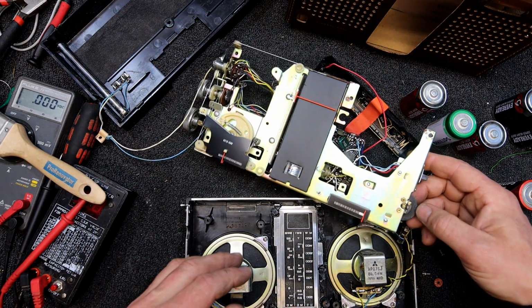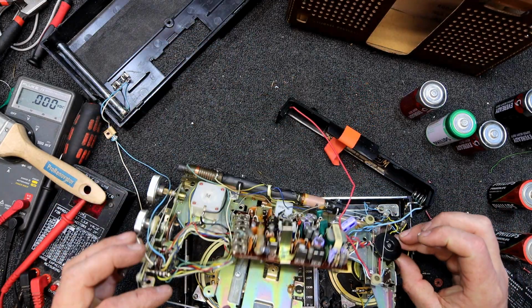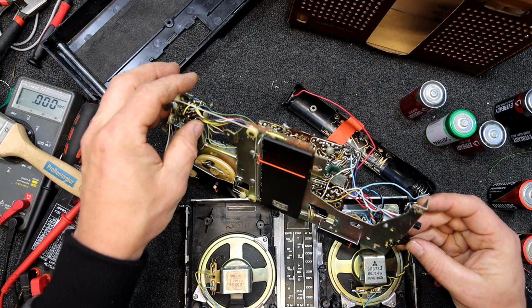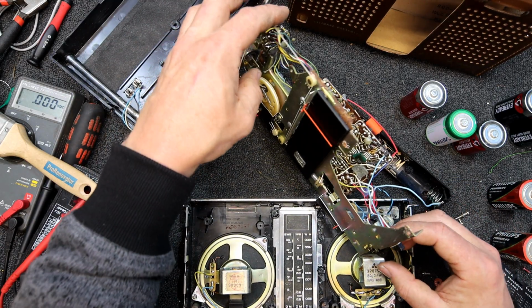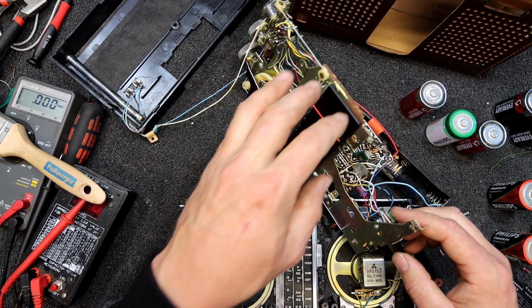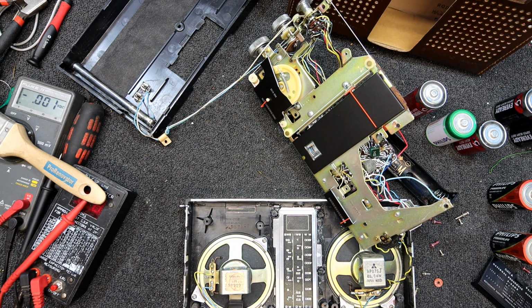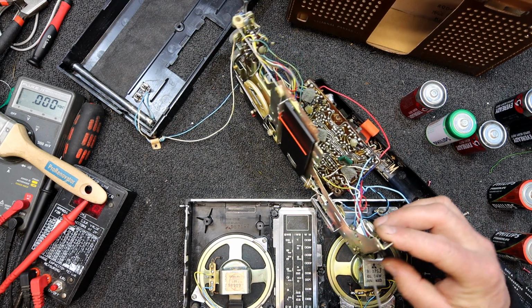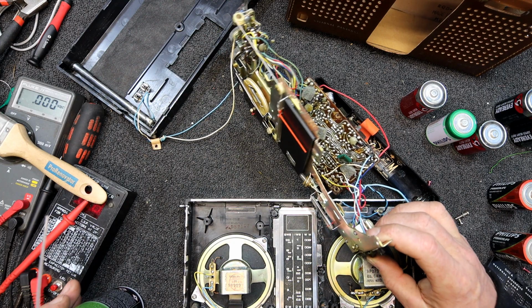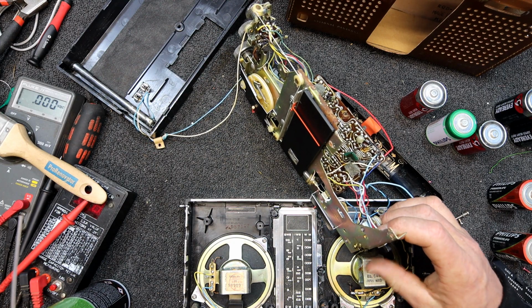And yeah, I might give that pot a clean. I think you really got to take the knob off it, but it's got a dial cord in this one just to make life difficult. I wonder if we can get a bit of cleaner in there without doing that. Usually got a plastic cover on them, is the problem. And a very tarnished old switch. They often gave trouble, these sort of things. Which again shows how good quality the ones were in these, because they generally didn't.